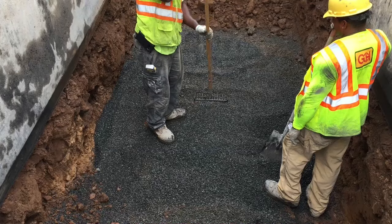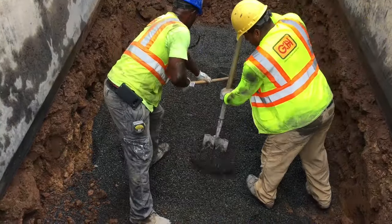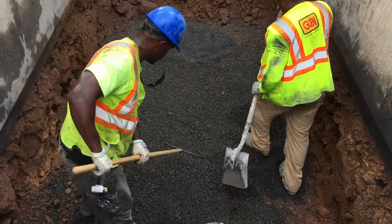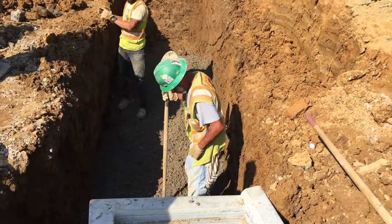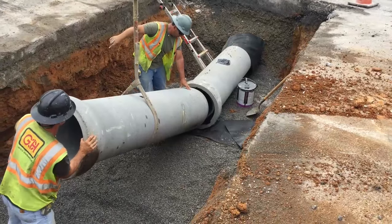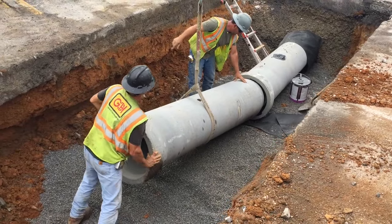Create an appropriate bedding for the pipe installation — it should be 6 inches deep. For concrete pipe, bedding consists of AASHTO No. 8 Aggregate. For metal and thermoplastic pipes, bedding consists of PennDOT No. 2A Aggregate material. Do not compact this pipe bedding. Pipe should be placed with bells or grooves upgrade, with the spigot ends fully entered into the hubs.